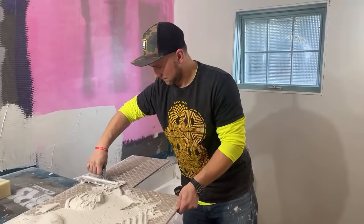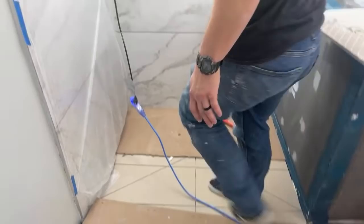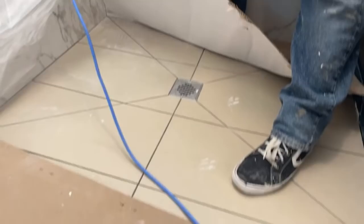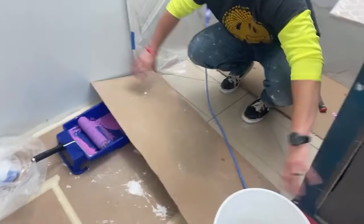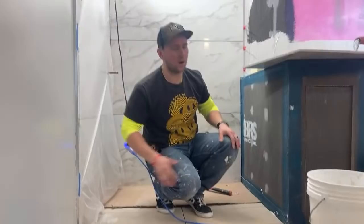Shay says, I tuned in a little late, how did you do the bottom of the shower, or did you do it yet? So this is actually a curbless shower with these envelope cuts. Look at that. I even pitched this front row of tile on the entire bathroom this way a little bit, so any water even beyond the shower kind of goes in. I have a full video on that on my page if you want to see the whole process. It's pretty cool.